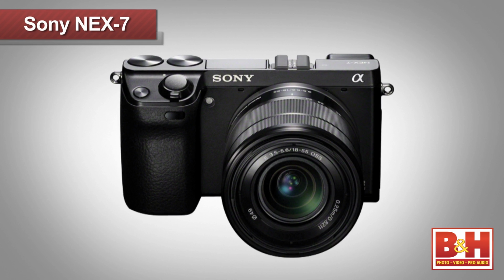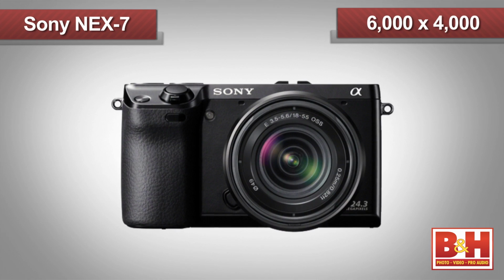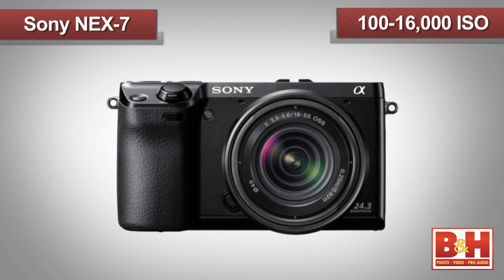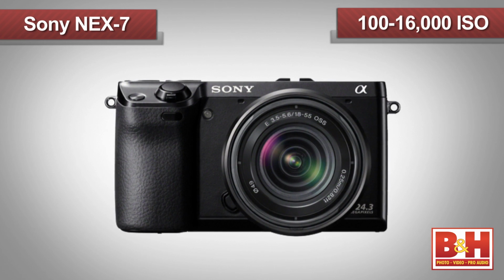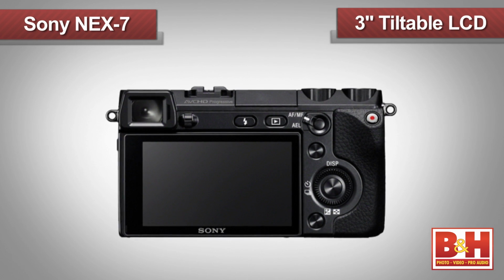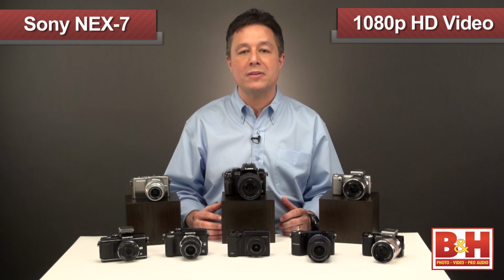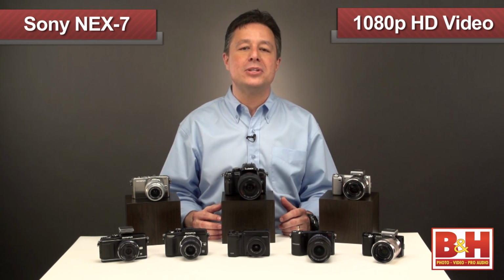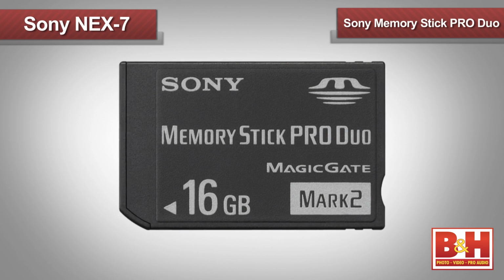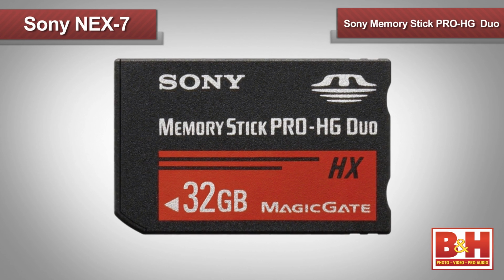And finally, the Sony NEX 7 has an amazing 24.3 megapixel APS-C CMOS sensor, and it can capture images at a resolution up to 6,000 by 4,000 with an ISO range of 100 to 16,000, and it has an auto ISO function. The 3-inch 920,000 dot resolution LCD is tiltable. The NEX 7 can capture JPEG or RAW stills at up to 10 frames a second, or 1080p HD video at 60 or 24 frames a second with stereo sound, and it saves the images all to SD, SDHC, and SDXC memory cards, or of course, Sony's Memory Stick Pro Duo or Pro HG Duo memory cards. And like all Sony NEX cameras, you can use the full line of Sony E-mount optics.